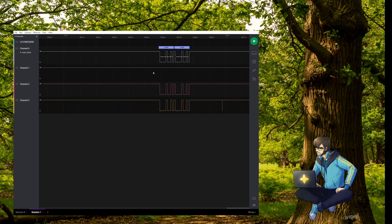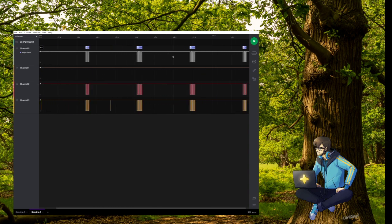And instead what I see is them grouped like 1, 2, 3, and then waits, and then 1, 2, 3, and then waits. Now I'm going to send 6 bytes at a time, so that part is helpful, but it also means that it's buffering. I don't want it buffering. It has an RX buffer of 256 bytes probably, but that's still not what I want. I need to be able to configure the UART differently, I guess.